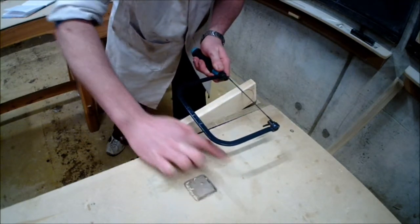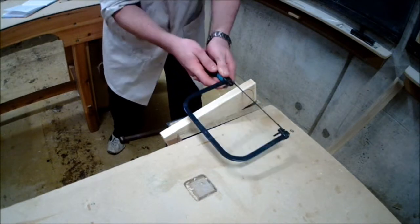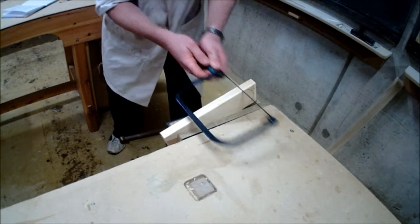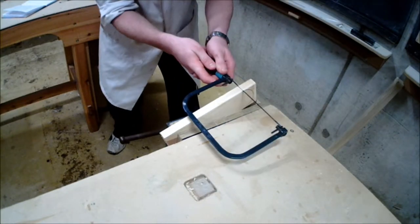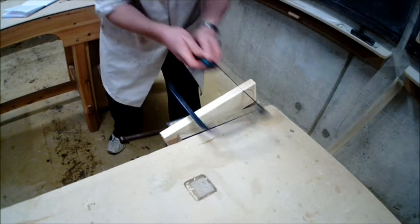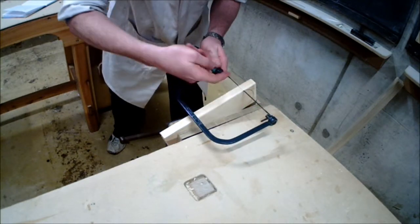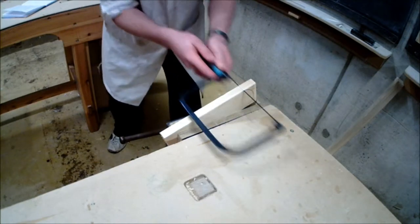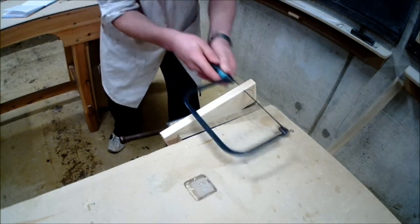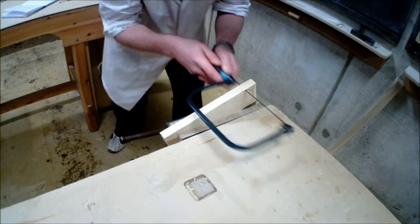As you can see, I'm using the full length of the coping saw blade to ensure that I'm removing all the waste material and sawdust being created. It's also important to ensure that you have your blade parallel to the bench to ensure you have a good accurate precise cut all the way across your piece. If you don't have the blade parallel to the bench or the vise, your cut will be inaccurate and also off your marking line.